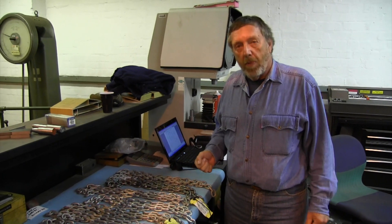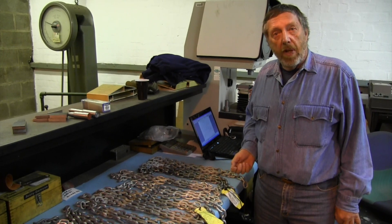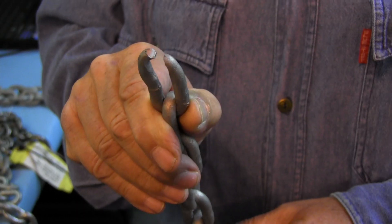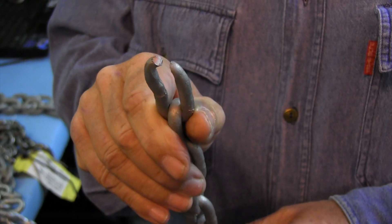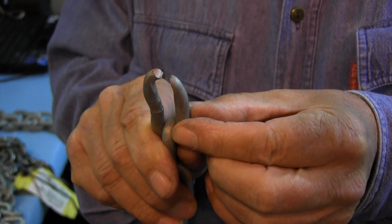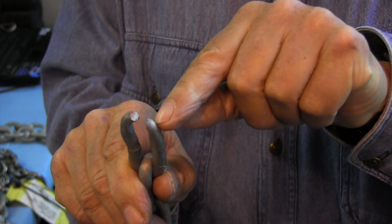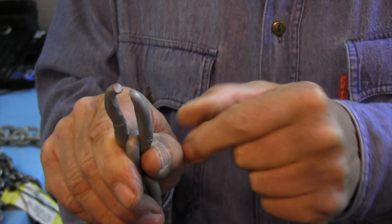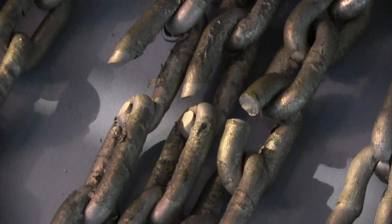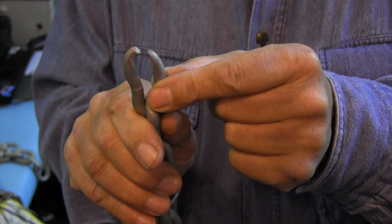All of these have now been pulled in the tensile tester. We've recorded all the results and we can observe that there are three different fracture types. This is a very typical tensile failure in a ductile metal — the fracture is known as a cup and cone type. We have a cone shape there and a cup type there. There's a lot of elongation and the appearance of the fracture is somewhat known as woody; that is a very typical ductile fracture.